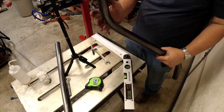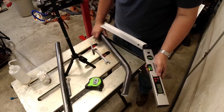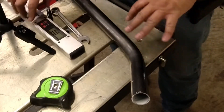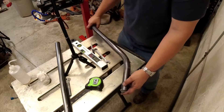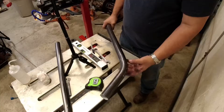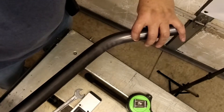On a new piece we overbent this side slightly — we're within a degree so we'll call it good. Keep in mind you'll need to go through your bend allowances: if you change wall section you won't have to change your angle measurements, but your springback will change with every diameter and wall section. On a 45, it looks like we used about four inches of material — once again it almost works out to a degree per inch. You can see right where your bend starts.